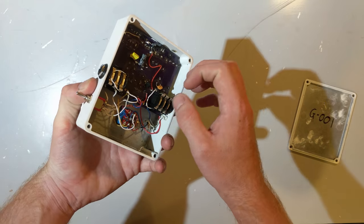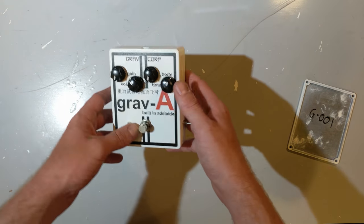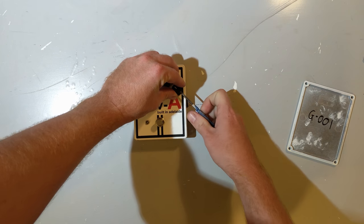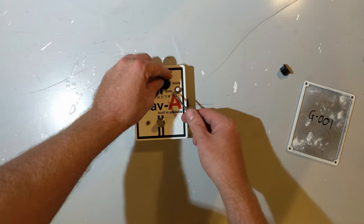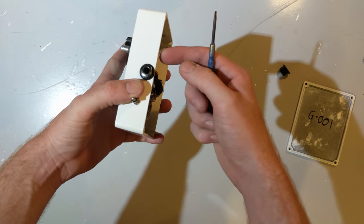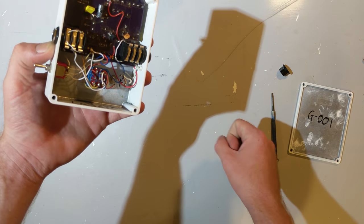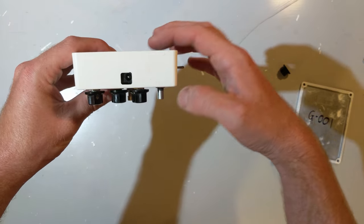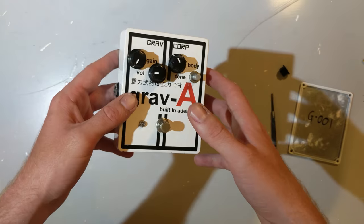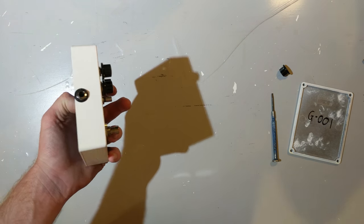And so I soldered up a board, posted it over to them, which took 2 weeks because, again, didn't have a lot of money for express postage. They sent me back these and they didn't fit. The way this board locates in the case is through these four potentiometers here, which are bolted on like so, and the two input and output jacks on the sides. It was intended, as I said, that the barrel jack would pop in to the rear of the case. It didn't. I iterated on the board, trying to make things better, which took another month.